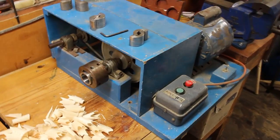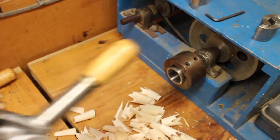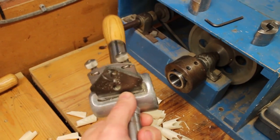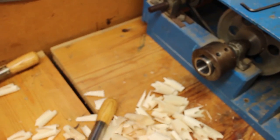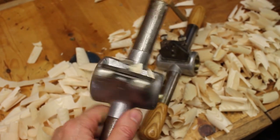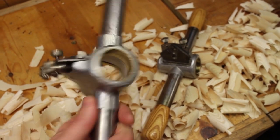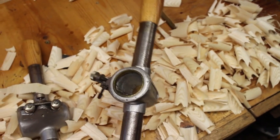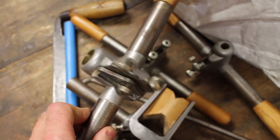Here's a funny little machine that I use just to turn the spindle of wood. I use these giant pencil sharpeners called rounding planes to actually take the shavings off the wood and get it into shape. I have different sizes of these rounding planes, so I start off with a large one and work down in size — I've got some smaller ones here as well.